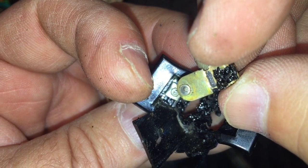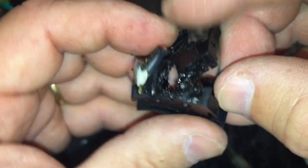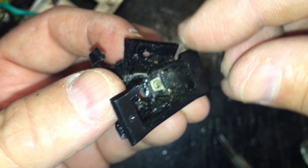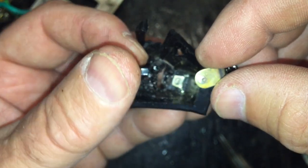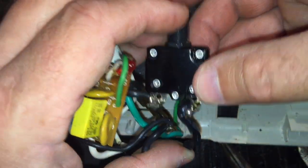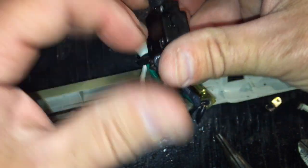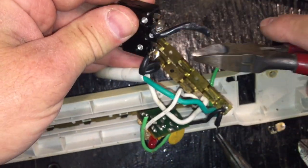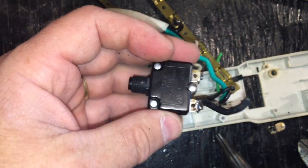I would say this was still not as dangerous as I thought initially. Obviously not great, but I don't think this was going to be a fire that would have sustained itself. It wasn't shorting out — it was acting more like a resistor, so it was adding enough to the party where I would have still thought it would have popped that breaker. But the breaker didn't go, and the breaker doesn't even look injured. The breaker is a heavier type of material — feels like almost like a Bakelite.